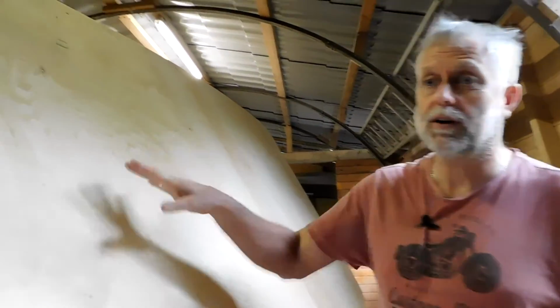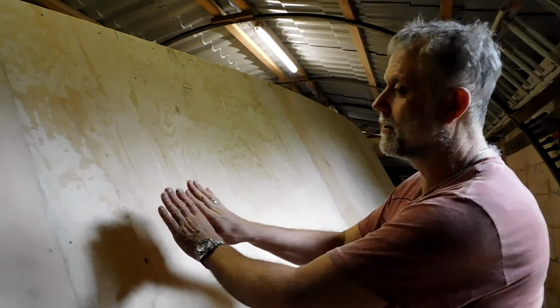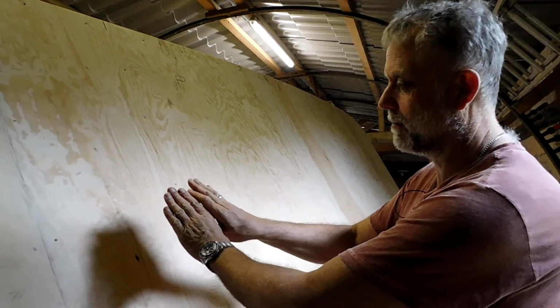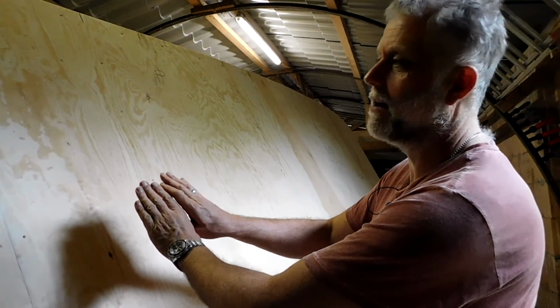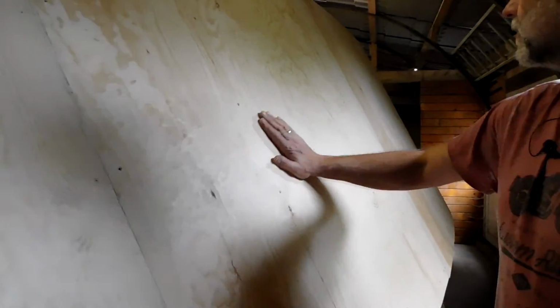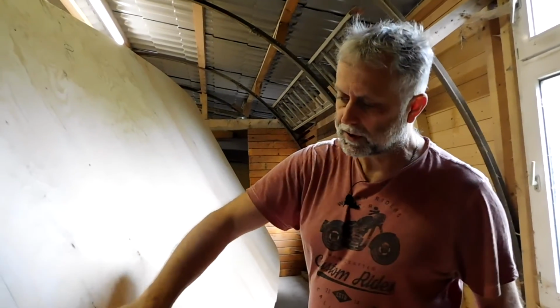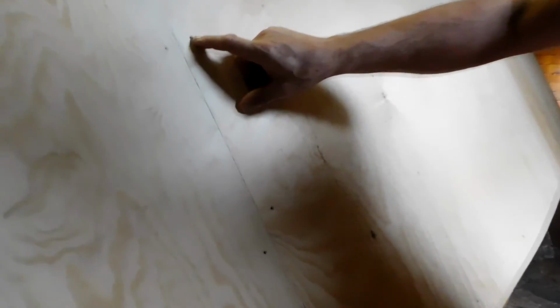Anyhow, let's have a look. Hazel, if you turn around, so here's the bow. It still needs a trim up around the stem, around these tops haven't been planed up quite yet. But you remember in some places where the boards were joined on the first layer that there was some not quite alignment there, or they weren't in line. But where obviously I've staggered the second layer, half board stagger, where that's covered those joints, they've lined up perfectly, absolutely perfectly.